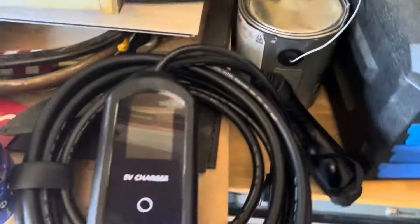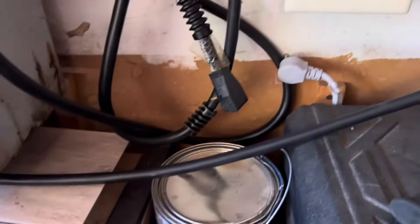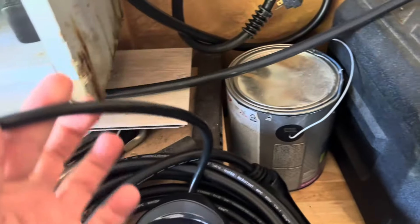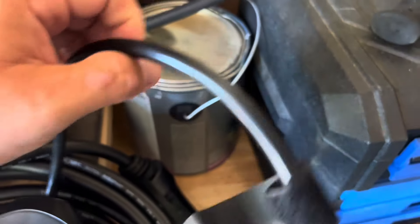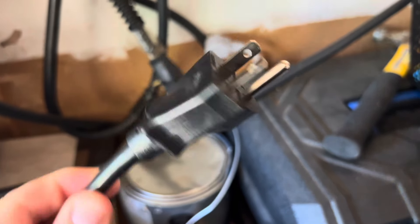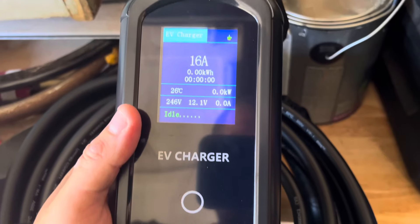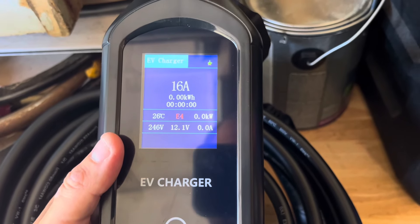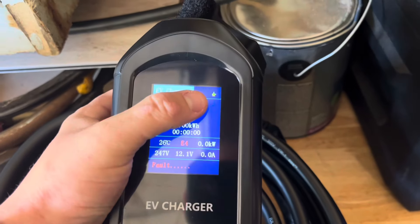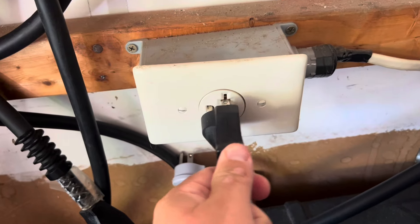Let's go plug this in. Over here on the wall we've got our 6-20 plug — I'll unplug my wall connector. Looking at this cable, you are limited on this exact unit because of the cable size. It looks like a 12-3, so your maximum is 16 amps continuous on a 20-amp circuit. Plugging it in — it comes up automatically to 16 amps, which is the max, great. But it says there's a fault. This is the first time I've ever plugged it in. There is Wi-Fi shown, but I'm not sure why there's a fault — I'll unplug and replug.